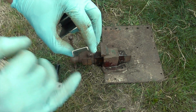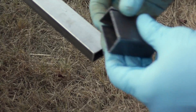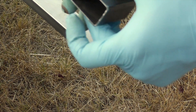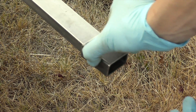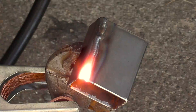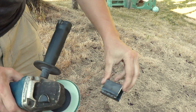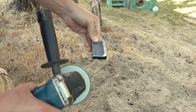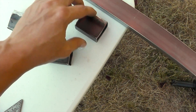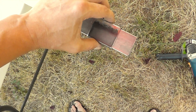I'm going to grind down these edges until this plate is flat and flush. After some grinding, I took off more from these edges — this is what I got. Now I get minimal slop. Time to weld it up. Now I'm going to clean up the weld. Got all three of them done — they just slip right over with very minimal play up and down.